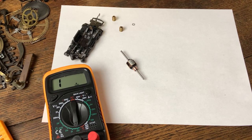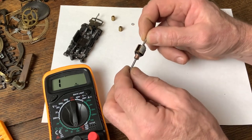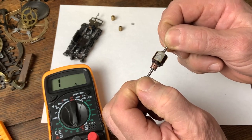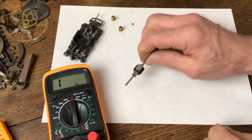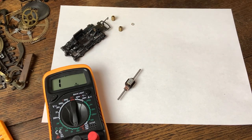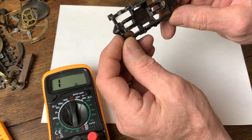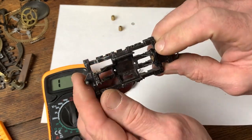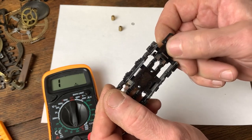The type of joint - I don't know whether it's a delta style of winding as opposed to the star type, but I'm really pleased with how that armature is looking. It's time now to see if we can get it running. I'm going to attempt to get the armature back in the motor bogey. I'm not going to have time in this video to get the motor bogey running around the track - there are a few other challenges - but let's see if we can get the motor spinning. One of the bearings is held in with a tie strap.